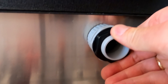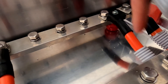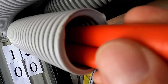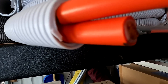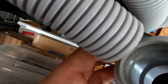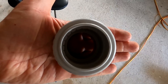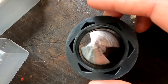The next task would be to drill holes here for these glands. I just don't know where and how many I need - do I need two per connection, positive and negative, or do I get two into one gland? I've got this 40 millimeter conduit here and two 35 millimeter cables go in very easily. The next size down is not enough to fit two of the 35 millimeter cables, so for all the big loads or solar charge controllers I need the 40 millimeter conduit anyway. These are the glands for it - look at this, they are huge. Look at my hand - that gland is insane. My step drill is not large enough for these holes - I probably need to mark all these holes and use the jigsaw.